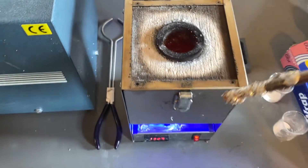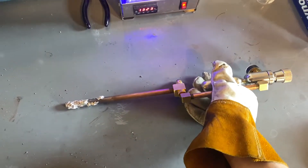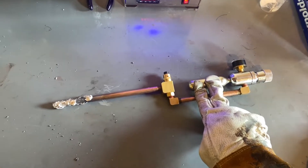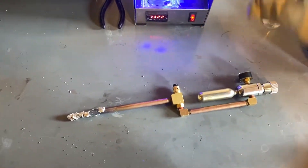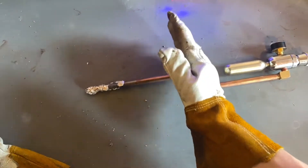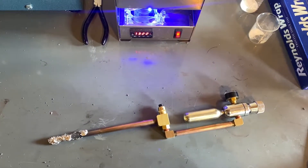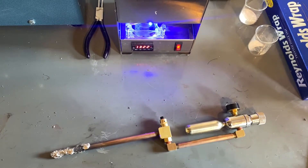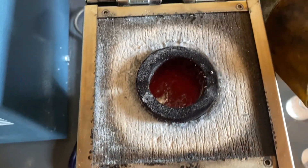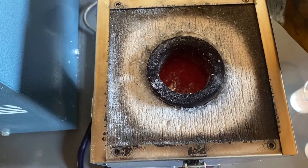The process looks really good. My hand is getting slightly warm but it's still comfortable — I'm not in discomfort. The cartridge actually gets quite cool as it releases gas, which is funny: really hot on one end, really cold on the other, with somewhere in between being comfortable. I may add a little metal baffle here to block some of the direct conduction heating. I'm going to go ahead and put some flux in using my graphite stirring rod, and then I'll pour it and we'll see how the ingot looks.